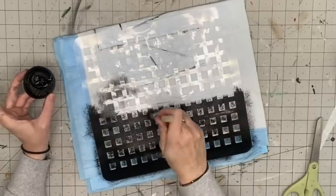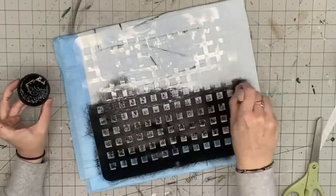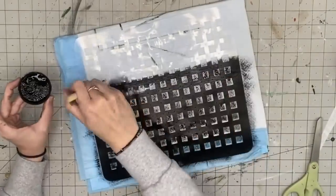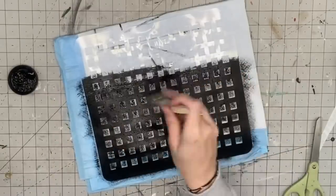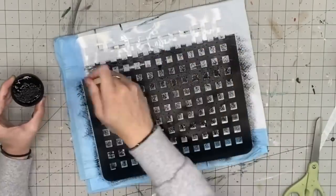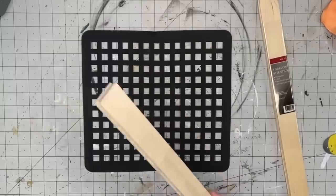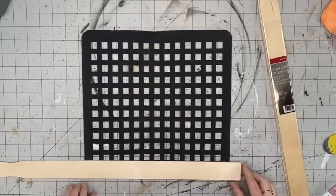But I'm gonna give this two coats of the black chalk paint, and I like to stipple my chalk paint on. It keeps the streaks from the bristles away, if that makes sense. Okay, so two coats of this. You can coat it with Mod Podge after so you don't have any flaking. Then grabbing gallon stir sticks. These are from Walmart. Wally World.